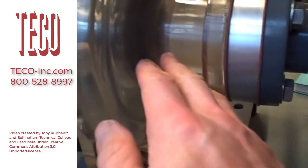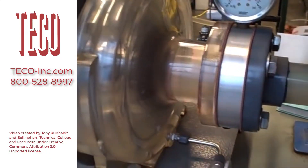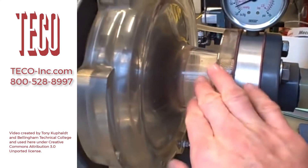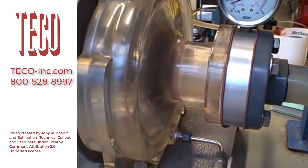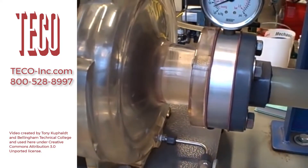We can see it happening here, and we can also see some bubbles here at the scroll casing of the pump. Cavitation is very destructive, especially upon metal surfaces. The acrylic surfaces here seem to handle it a little bit better, but with metal surfaces there's no give — that's very destructive. The metal will become pitted by the high pressure jets formed by the collapsing bubbles.